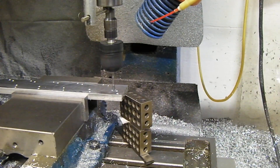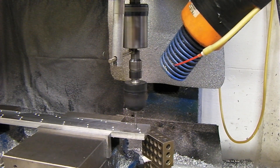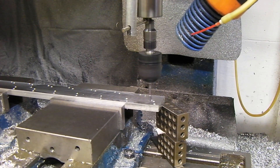I didn't write any fancy scripts. I'm using Mach 3 and Cam Bam for my CAM program. The tapping head goes in reverse at twice the speed, so using a standard drill command, the problem is your retract is at your rapid speed. With Mach 3, if you lower your feed override it will also lower your retract speed. So I calculated my RPMs going down and kept lowering the feed rate — it feeds at the correct rate and just retracts slower. I'm feeding at 17 inches a minute and retracting at 30.